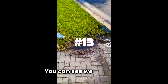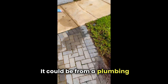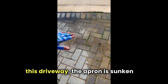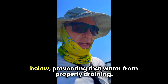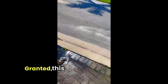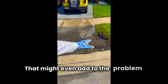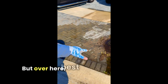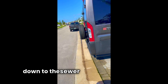Here we are on the front elevation. You can see some pretty significant water collecting here — it's been there a while because the grass is not growing. It could be from a plumbing leak from the sprinkler system. What's not helping is that this driveway apron is sunken in. This gutter right here is almost a half inch below, preventing the water from properly draining. This also needs to be built up, and it might even be the cause of the sidewalk cracking right there. This community is still under construction, so the road is still going to get a top coat, but that won't solve this problem. The best solution is to rebuild this apron and build up the yard so it all properly drains into the drain and down to the sewer.